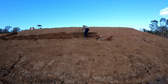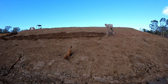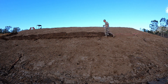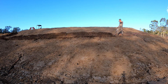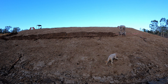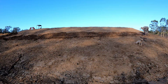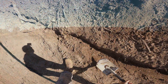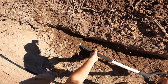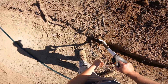At times like these, teamwork makes the dream work. Something I realized only towards the end of this project is that we should have been digging the trenches in the opposite direction to what you see here. Because doing it this way, the bottom of the trench remains uneven after pieces fall out of the shovel. But if you dig in the direction you're facing, you'll scoop up all the bits that drop out as you go and use less energy while being more productive. Here is an example of doing it the right way — you only need to do one pass over each trench and you don't need to tidy it after you're finished.